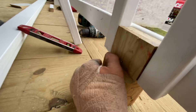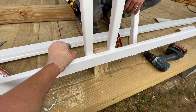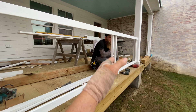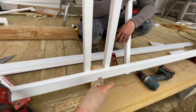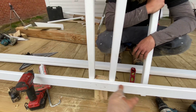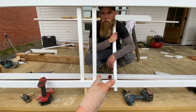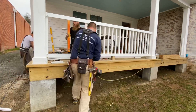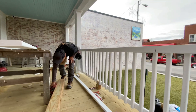You can see there's a little ledge here. This is one piece I sawed out of a six-by-six to make a special shape block that's going to support the rail in the middle, because it's really bouncy — this section is a little more than 10 feet wide, so we need to secure it in the middle and give it some vertical support. We've figured out our spacing, making sure there's a space in the center of the whole width — not a picket — so that post could be in the center. Now we can actually put some pickets on.